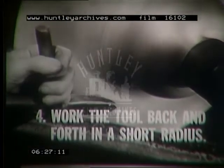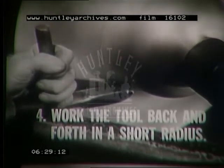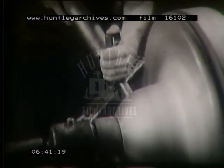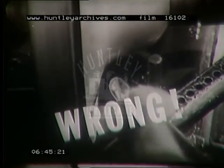4. Work the tool back and forth in a short radius, and we mean short. The arc should not be more than an inch or two on either side of the pin. So move the pin frequently and keep the tool at right angles to the point of contact. Don't work the tool continuously from the center out. That will thin the metal to the breaking point. And avoid working the same spot over and over. There's a lot in leaving well enough alone.